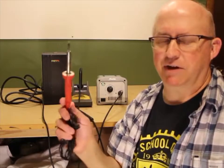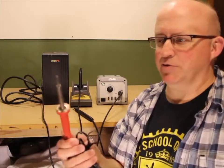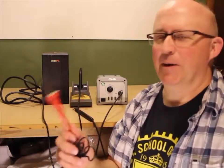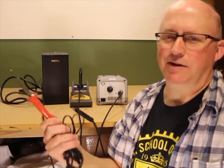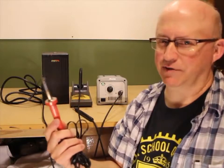Now there are two different kinds of pencil irons - ones that have temperature adjustment and ones that don't. This kind of inexpensive $15-or-less pencil iron that doesn't have any temperature adjustment typically has these little thread-in tips that are kind of cheese ball. Don't ever buy an iron like this - they're bad. For like $10 or even $5 more, you can get something that's a lot better quality. Friends don't let friends use these things - you can solder stuff together with it, but it'll just frustrate you to no end.